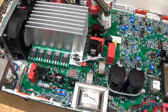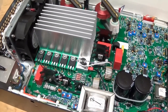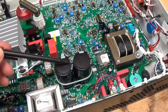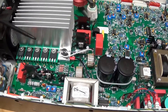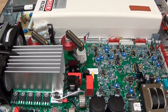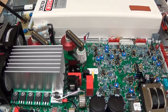So imagine what's happening here - how they're generating the high voltage. They're taking the AC line power coming in and rectifying it. Right here is just a regular diode rectifier with a couple of big filter capacitors. So they're taking the line power, rectifying and filtering it to get DC out of it. Then over here on this heat sink, all these transistors are chopping it up with switches and making it back into AC again, feeding it into these two flyback transformers - which look just like what you'd see in an old CRT monitor. Then boosting it up to some high voltage and passing it through into this box here.